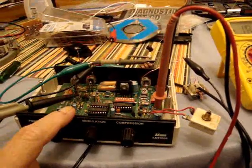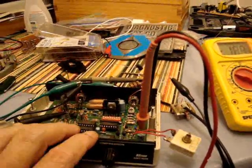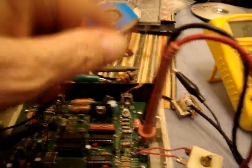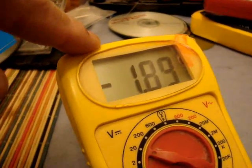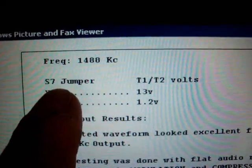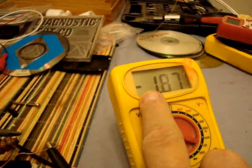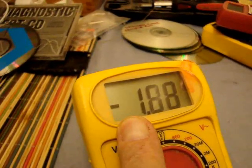In conclusion, we can say this is a pretty good little transmitter for linear modulation or proper modulation. It's important to follow the setup here for proper operation. This is with S7 removed from the position. I've set it up, instead of for 1.2, for a little on the high side — 1.9 volts. Here is the first test I did with the S7 jumper removed. Here's the T1, T2 test point. This was the ideal voltage I got for the best response on the pattern. Back over here on the meter, I've got 1.9 volts — that's close to 2 volts that I've set it up for.